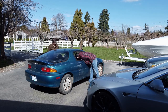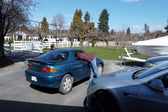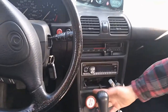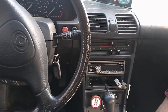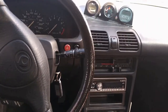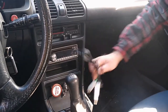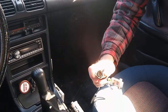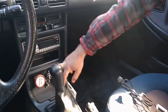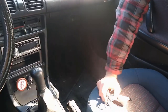It's got a nice little setup for the gauges — percent battery life, voltage, amp draw, and battery health. It also has a huge emergency shutoff that you can use in an emergency, and if you're doing maintenance you can pull that out and it'll disconnect the batteries. Remember, you have to install that per code to get it insured. We've also got access to the controller through this little unit here — we can plug it into a laptop and reprogram the controller, which is pretty cool.